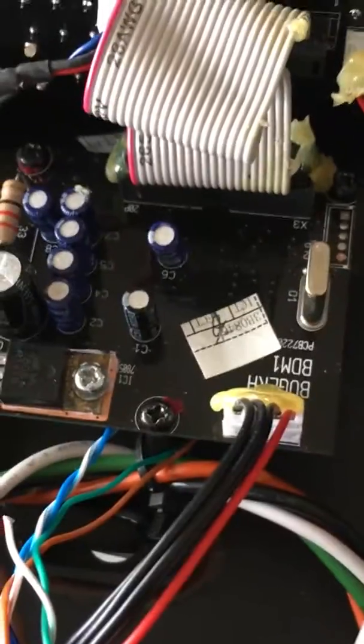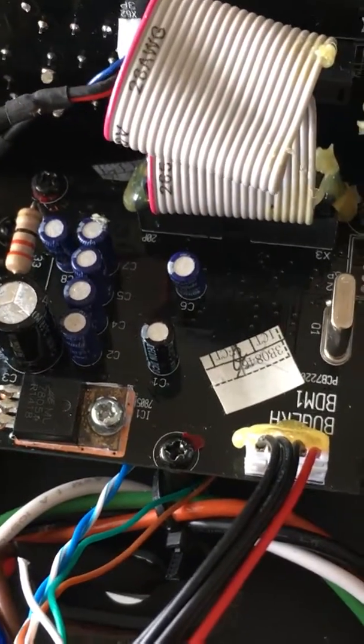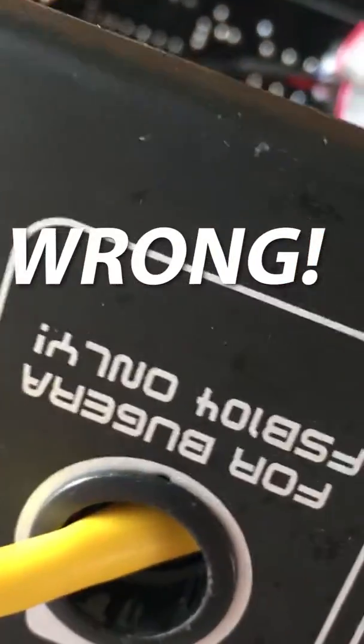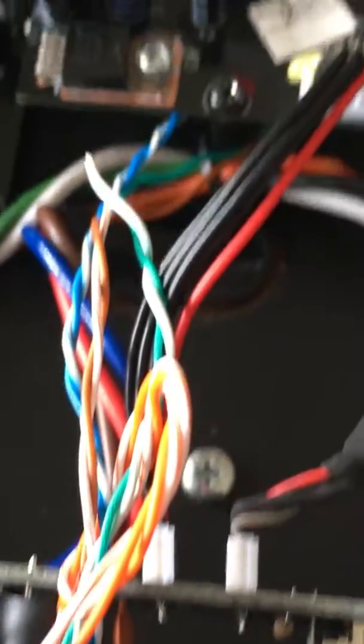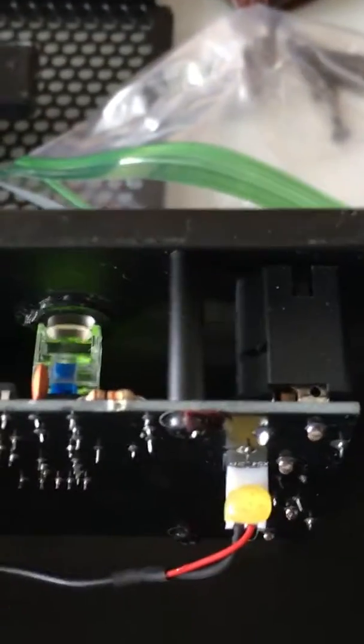This digital board does all the switching when you have the factory foot switch, but I don't. Initially I thought maybe I can just jumper some pins on the foot switch jack that's in there. That didn't quite work out, but what I found is that I traced this big ribbon cable to the front panel board and there are these momentary switches on the front panel.